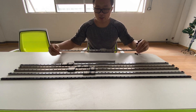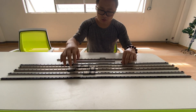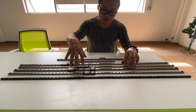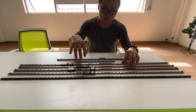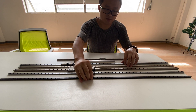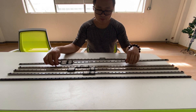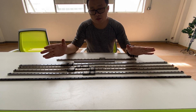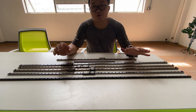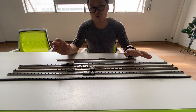After some time, the untreated rail gets rusting — you can see that both on the rails and the carriage. Of all three kinds of treatment, I will suggest the black anodized and also the chrome plated. Black anodized is popular for aluminum profiles you may use on 3D printers or sensing machines.